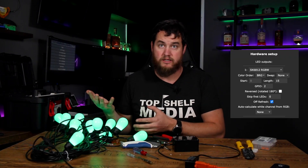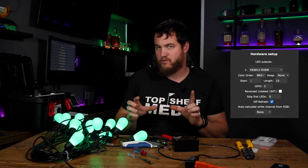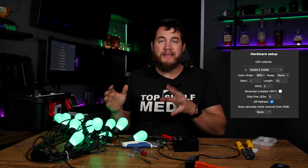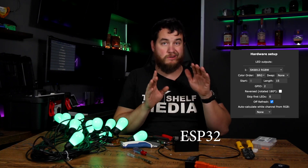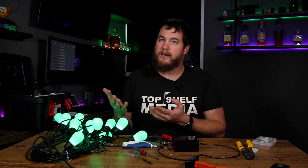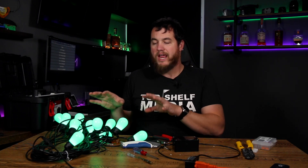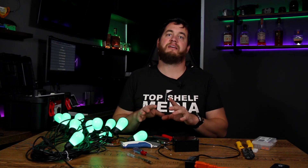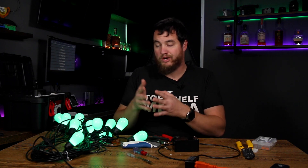It works. Now, does it work great? No — I'm missing about a third of the spectrum. Anything around a blue color just comes in as warm white, so we're having an issue there. Makes sense — these LEDs were not made to use an ESP32 board. They were made to use their own dedicated controller, but it would work in a pinch. The scenes work okay, you just don't get a blue color in any of the scenes. So it would work if you needed it to, but obviously contact Lumarie if you have an issue with your controller. They sent me one right away, so I'm assuming they'll work with you too. Probably better options than trying to do it yourself.